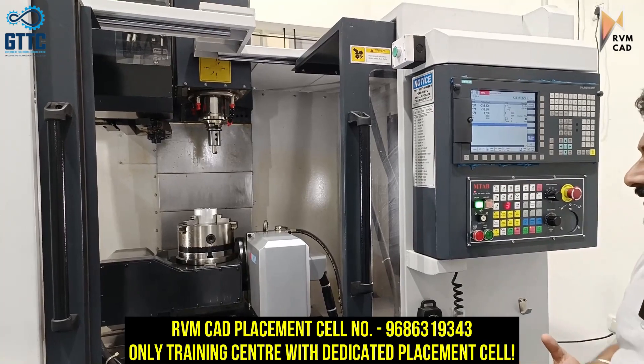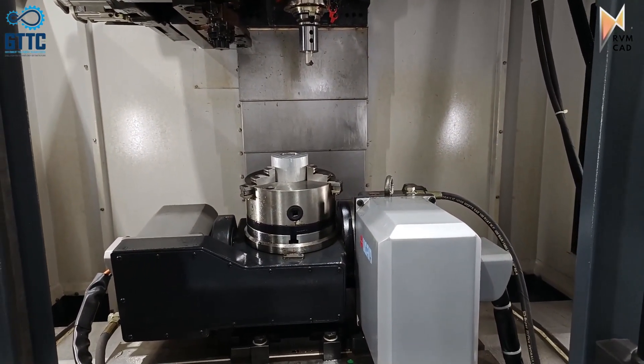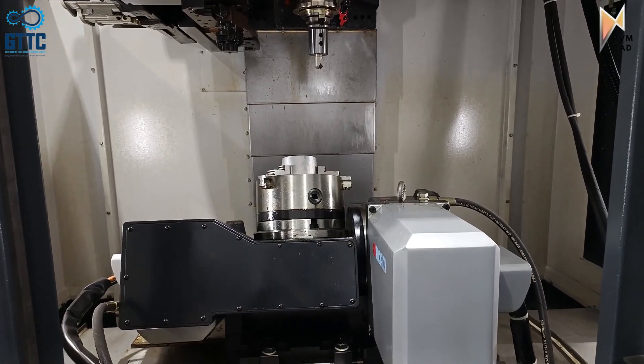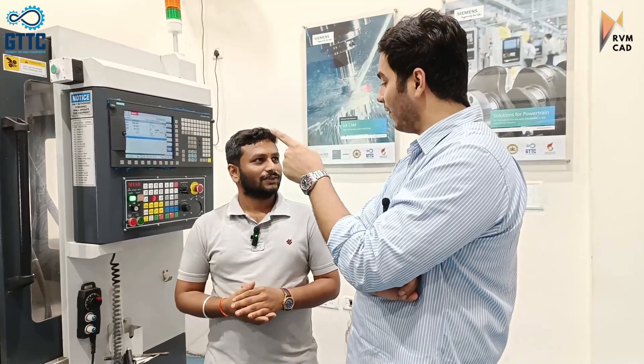Now the 4th axis — you can see the angular rotation. And the 5th axis is the revolving of the chuck. This comes into picture where there is a 3D profile to be machined, or angular holes — for example, in engines, we require angular holes. The whole engine block is placed and then rotated to do the machining. In some machines, only the spindle tilts. In this machine, we have the option for tilting the bed or attachment — that's why it's called 3 plus 2. This is basically a 3-axis machine with a 2-axis attachment, which is more than enough for learning and beginners.